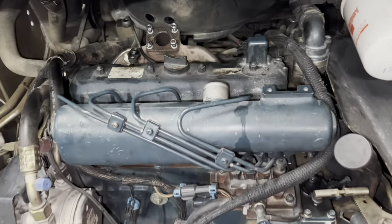All right guys, so the turbo that he bought, you guys can see I put the old one kind of back together. I don't have the clamp on it here, but oil on top, oil bottom here. So originally this one was clocked the other way. You can see where your wastegate was up here, the vacuum line for it.